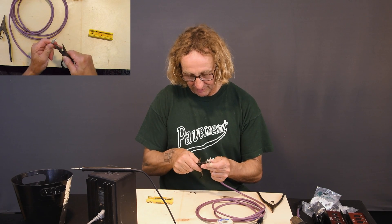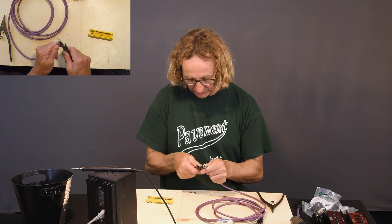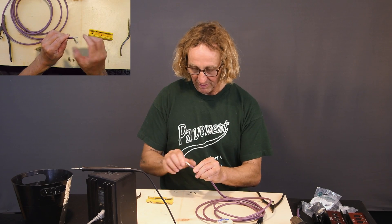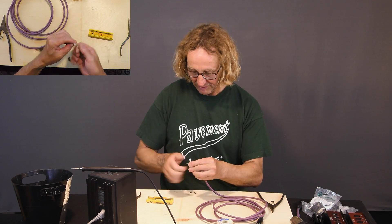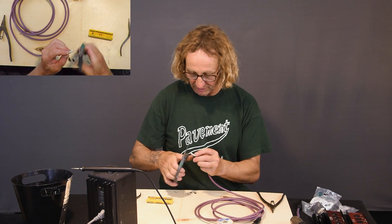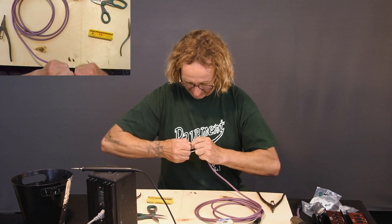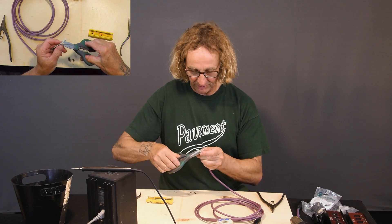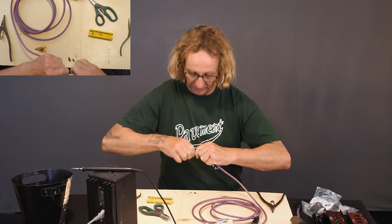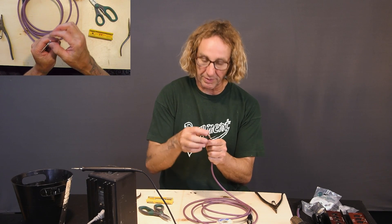What we're going to do is have a really easy way — since this is four channels of analog audio over CAT 5e, we've got all the ends in here and you don't even need to remember what to do. We'll just peel back this braid shield, pull that off. The Super Cat cable has got this rubbery, silicone-ish cover over the pairs. Just tear it away — usually you score it a little bit. It's very gooey, which is part of what makes it really flexible and protects the cable. It keeps all the pairs perfectly separated.